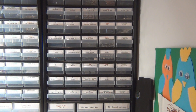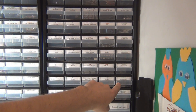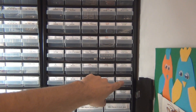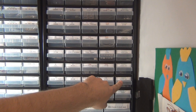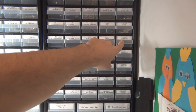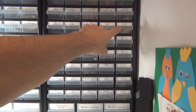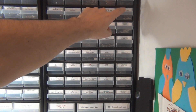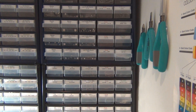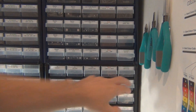Moving on to transistors: the 2N5089 is used occasionally, not as common as the 2N5088 which is used a lot. The 2N5087 is used quite a bit as well. In order of commonness: 5088, 5087, 5089. The 2N3904 and 2N3906 are also common and used quite a lot. 2N7000s you don't use often - that's more of a specialty thing. The MPSA13 is pretty popular and used quite a bit. The S9013 is a cheap NPN with low gain - not something you'd bother stocking up on.